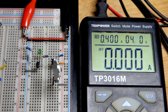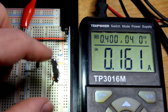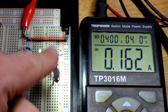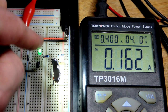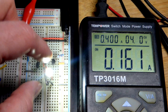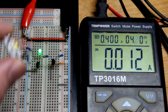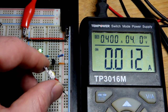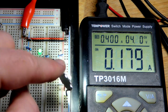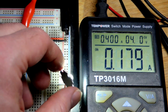In this video we're going to do another circuit where if we have enough voltage the LED is on, and if we lower it enough the LED will be off. Almost all of this current is actually through the LED — the other components need some current too. The transistor is dropping a little bit of voltage from the LED, so you'll see the current going through the rest of the circuitry, about 10 milliamps higher here because the transistor is not dropping voltage from it, but it's pretty much the same.